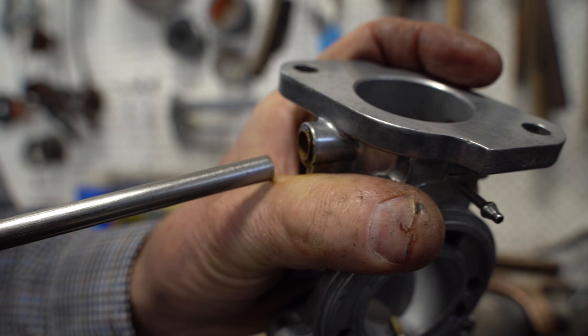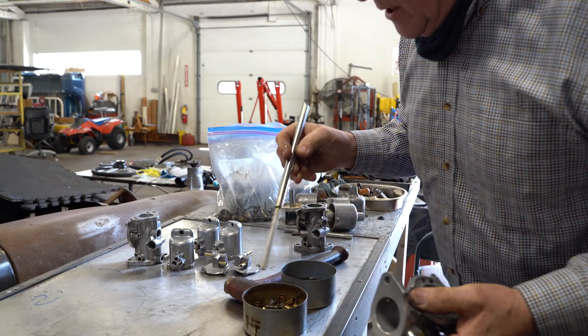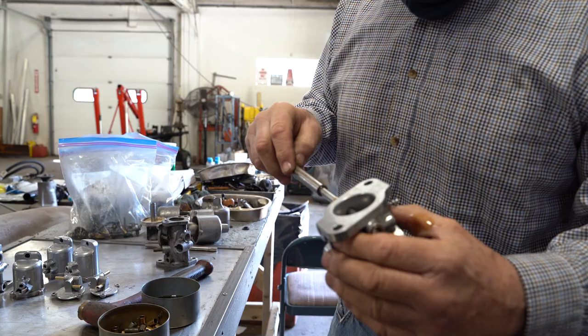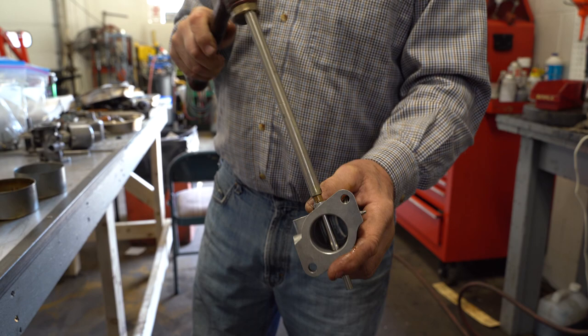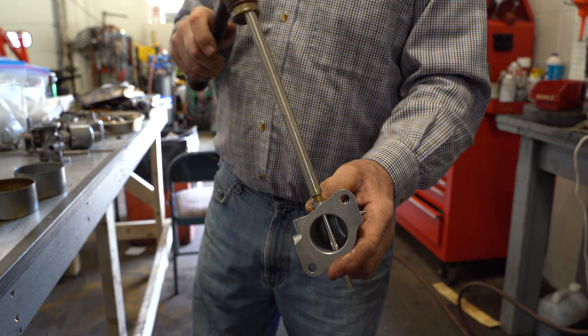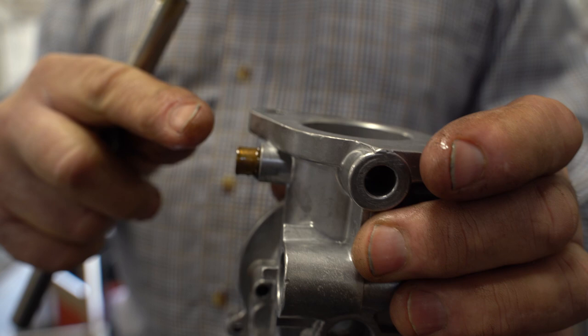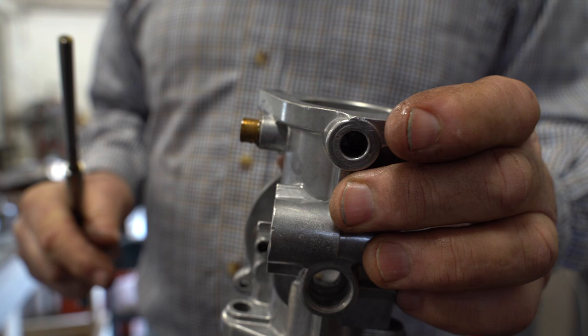My collar on my reamer isn't far enough back, so I'm going to use a longer bushing instead. I dropped this can the other day — it had oil in it until yesterday, it ran out. I'm going to use this longer bushing. You can hear it change tone when it gets all the way in, and it's still going to hang out on the end here because the shaft comes out that far — so why not give the shaft some support? It's going to leak less and wear more slowly.